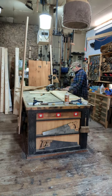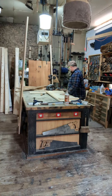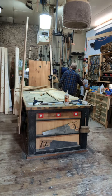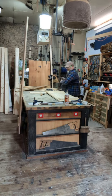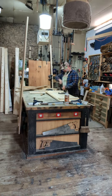Right, so this particular shutter here is done apart from the brace to go on. I'm just going to put a clamp on each corner of the shutter while the glue hasn't gone off fully yet. These regular ones, like so. I don't squeeze it up too tight, just enough to make sure it's going to adhere.